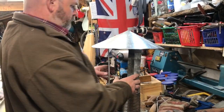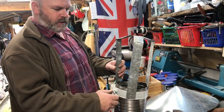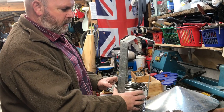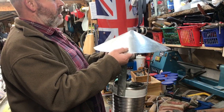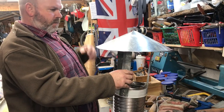I've got these bits fitted to the clamp I've made, so this is on a wingnut - I can just move it up or down to make the gap less. This is going to sit on there and I'm going to drill through and rivet them in place now.